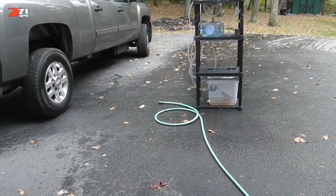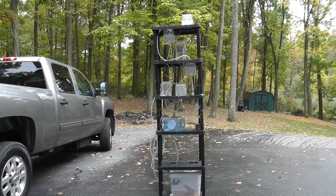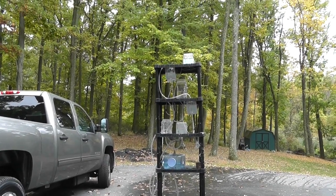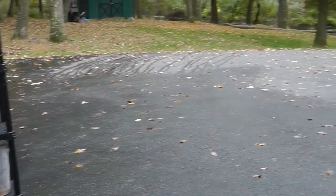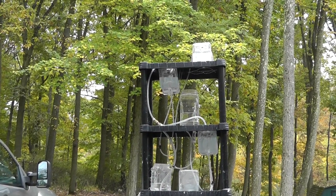Of course, if you stick this thing by a riverbed or something like that, as long as you have a continuous supply of water, you can pump this thing uphill. So you can take it from wherever you want, and you can go up like 15, 20 feet. And you just use an aqueduct or something like that and run a line to it. Or since you have the gravity drop, the hose can go from the top tank down, and since it's got that fall, it'll be gravity powered to wherever you want to take it, as long as the destination isn't as high as that.